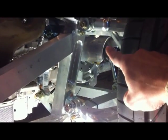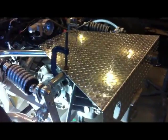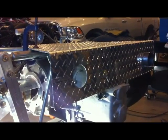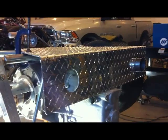The Z06 exhaust has to come off that stock stainless steel manifold down here, come up over the motor mount, and then up over that heat shield over the drive axle. Alright, I fabricated the aluminum checker plate there. That's basically a jig that lets me know where the exhaust ports have to end up in relation to the fiberglass cutouts in the back of the car.